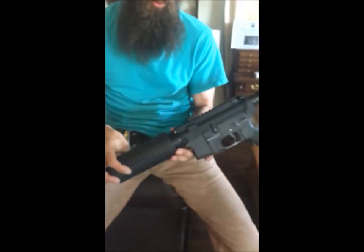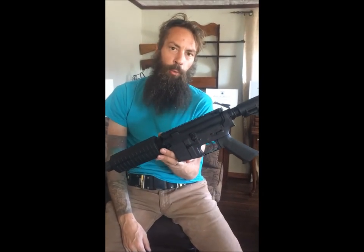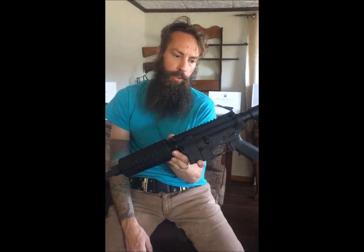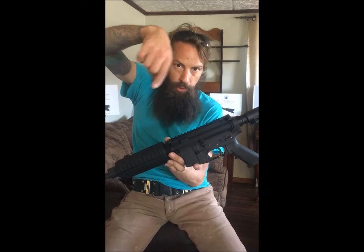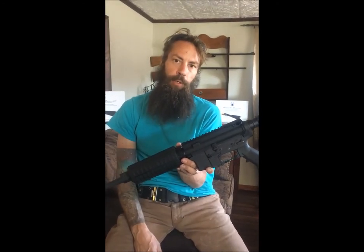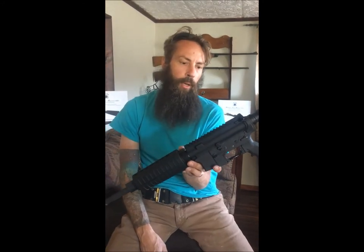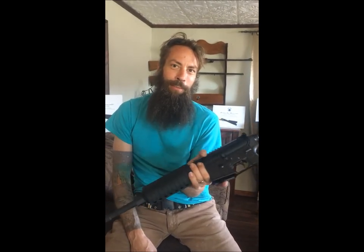Sadly, there's nothing we can do at this point except get a new lower. So go slow — maybe start with undersized drill bits and check your pin fit. Also check your drill runout; if your bit is spinning not square, you should be able to notice any play in there. Definitely start with an undersized bit because you're going to be drilling a larger hole than the diameter of the drill bit. Stay safe out there, have fun making guns — bye.